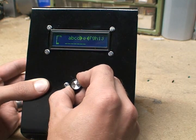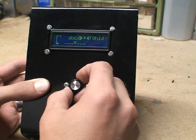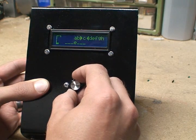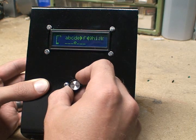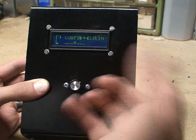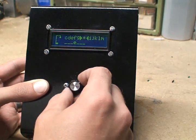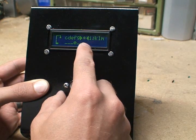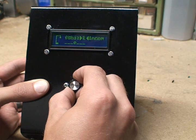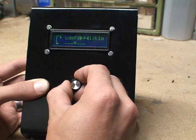So if I go through and I want to select something, I just push down on the potentiometer. If I get it right, there's also a little buzzer in there creating some basic beeps for notifications. But if you get it wrong, it buzzes at you. It also turns the letter you just guessed into an asterisk, so you can't guess it again. If I go back to that letter and click on it, nothing happens.